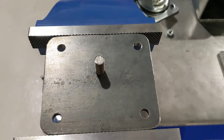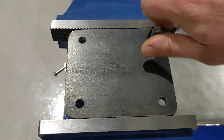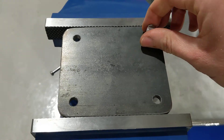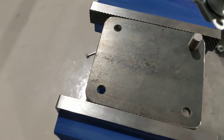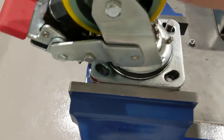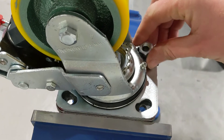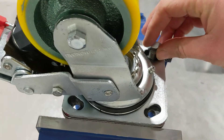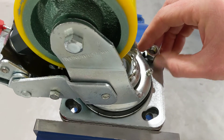You can see here's one I started earlier. These bits of threaded rod are going to be tapped into the plate like so, and then the caster sits on top. I will weld those studs in so they don't go anywhere, unlike this demonstration.